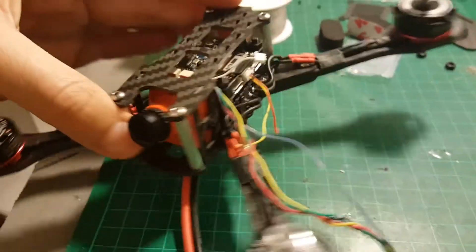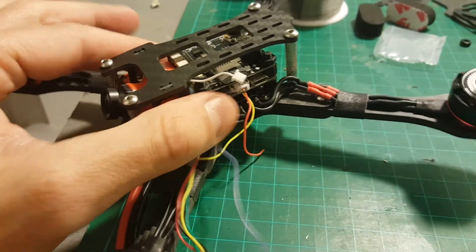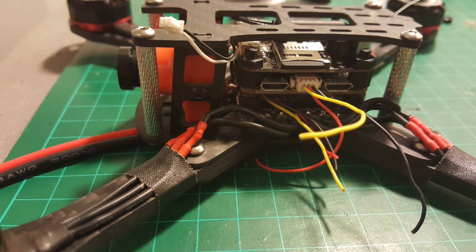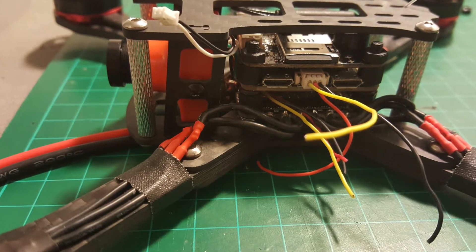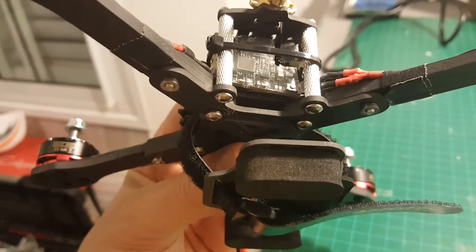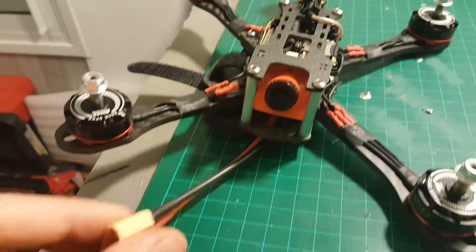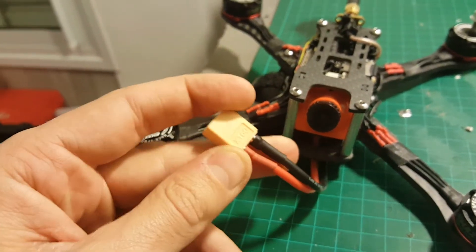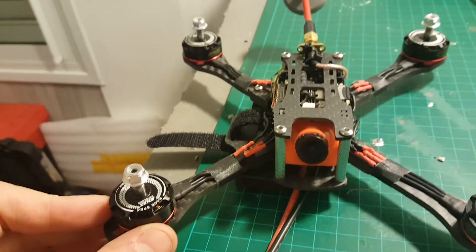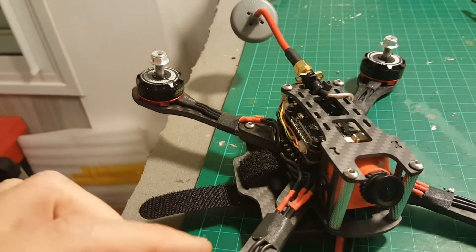Plus the top cover. The next thing I need to do is connect the wires from the camera to the board. Eventually I decided to go with the TBS-HV video transmitter because it was much more compact and it fit on the back of the quadcopter. I also soldered the XT60 connector to the battery.